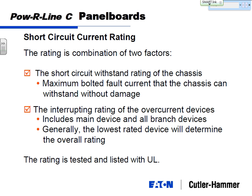But the basic circuit breaker, whether it's these small ones, that circuit breaker in that load center, the same one for a panel board, or even this 225 amp device, they have what is called the thermal magnetic trip unit. It's the standard trip unit, the lowest, most cost-effective trip unit. And functionally, it does what it says. It provides thermal protection and magnetic protection: thermal-magnetic circuit breaker.